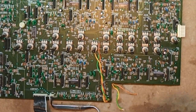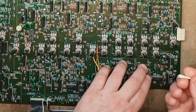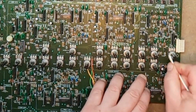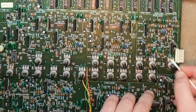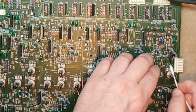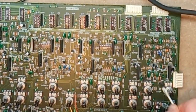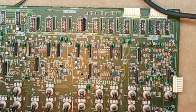Alcohol got its revenge when cleaning the potentiometers, though. The tops were very dirty, and I wanted to clean them before spraying contact fluid, because I worried about pushing more dirt inside. I dipped cotton swabs in alcohol and wiped around the top of each potentiometer, then used the dry end to wipe off the dirt. I had to do this two times per potentiometer, sometimes three or four — that's what 30 years of usage does.